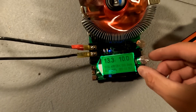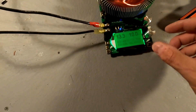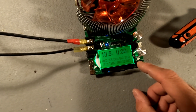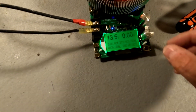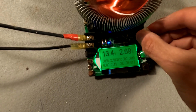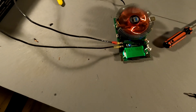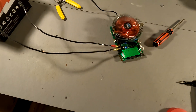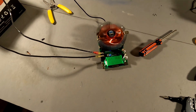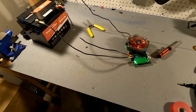We're going to do 10 amps — there we go, perfect: 10 amps at 13.3 volts. Oh wait, I forgot to reset it — let me turn it off and reset it. Okay, so it'll probably read about 49.9 now, but we'll see. We'll let this run for five hours and hopefully it reads right around 50 amp hours. This will be the test to confirm whether this battery tester is accurate.